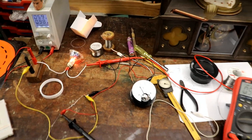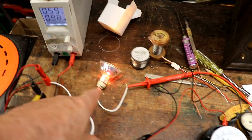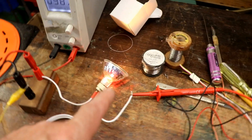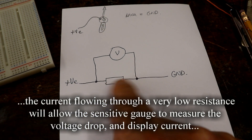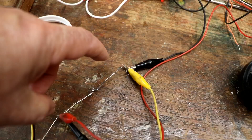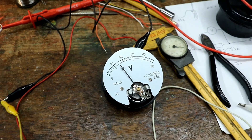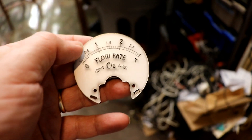This is working really well. I haven't experimented with electricity and current for such a long time. Just using that 12-volt, 20-watt spotlight thing — it's brilliant as a resistor, because it's dispelling all the energy as heat and light. Shows you why you shouldn't use incandescent bulbs. So I've got an amp going round. I've fiddled around with this wire — found that two bits that long works, because obviously I don't want it too thin or it might act like a fuse. That's pointing roughly to an amp. Very pleased with that — Coulombs a second flow rate, nicely balanced.